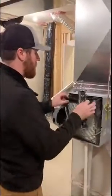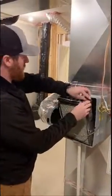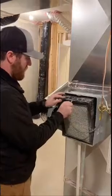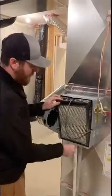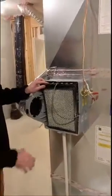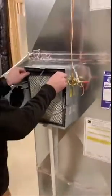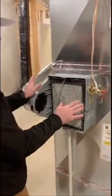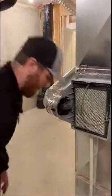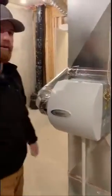That paint stripe goes up — you always want to make sure you put it in with the paint line up, because these are directional. Pop the new filter in. Put the water panel back on. Get that water line back in. Always make sure this gets seated so that it drains into the drain pipe, otherwise you're going to have some leakage. When you put this back in, make sure it clicks on both sides and locks in. Open the damper back up and put the cover back on — you're good to go.